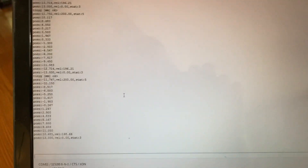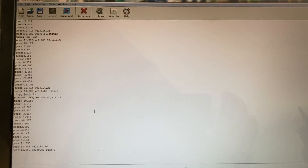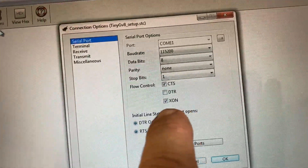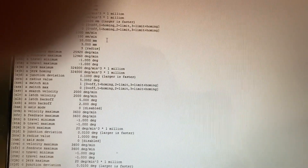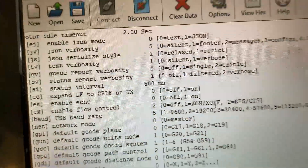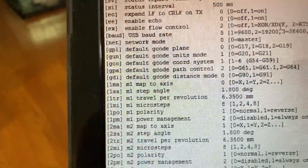I learned something critical when reading the wiki for setting up this board using CoolTerm. In the options you can see where I had CTS checked — there's also one that says XON. If you look in your settings, CTS is checked, so I was actually configured to read XON on the flow control. It was not set to CTS before, but it is set to CTS now.